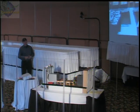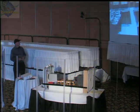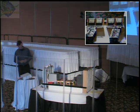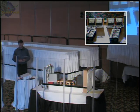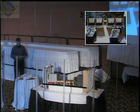So that's about 60 watts, say, 65 watts. And the other meter is reading 1/10 of an amp at 70 volts. So that's about 6 watts. And then it's a pulse motor, so the meters lie a little bit. It's even better than that. It's not draining all the time. So we're just going to let that run.